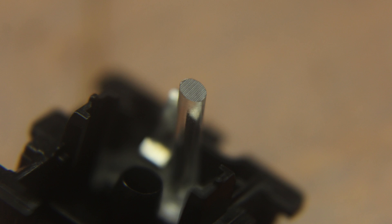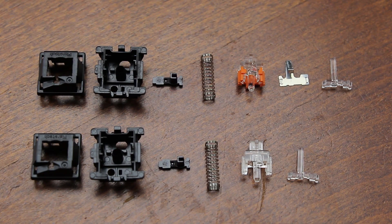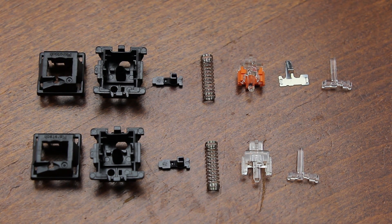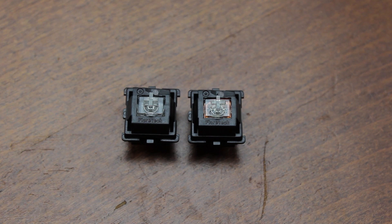Additionally, because the lighting is also mounted PCB side, the switches include a light pipe at the rear to funnel the light upwards. The top of the light pipe is chamfered off and notched to give a more even light distribution through it. Comprised of a top shell, bottom shell, optics part, coil spring, slider, and light pipe, the linear Flaretec switch consists of 6 parts, which is fairly low for such a complicated switch. The clicky switch has an additional click jacket and dummy contact for a total of 8 parts.